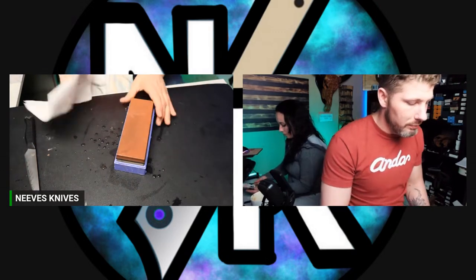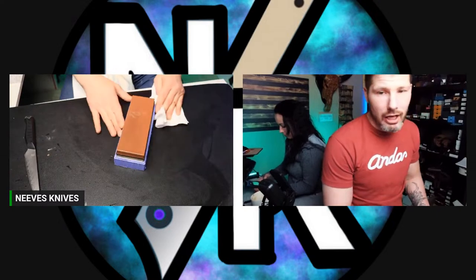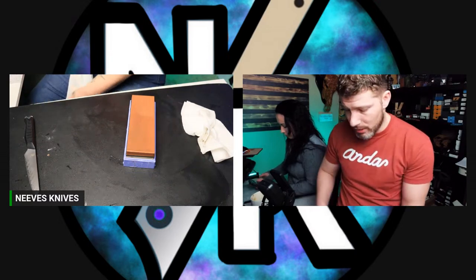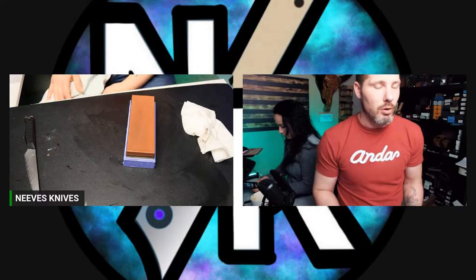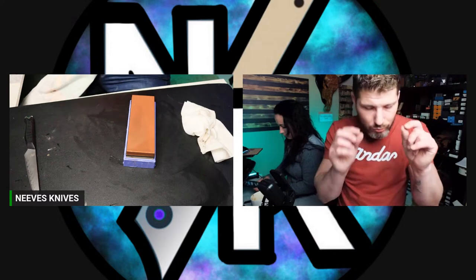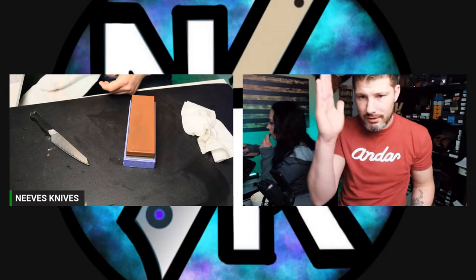I wouldn't. This is the thing, the factory edge is done by a belt. So there's two reasons why I wouldn't do that. One, it's most likely not a great edge. It's most likely a burnt edge. But the main reason is your scratch pattern is different. On a belt, the scratch pattern goes straight up and down. If you look really close to the edge like this, you'll see the scratch pattern go straight up and down.